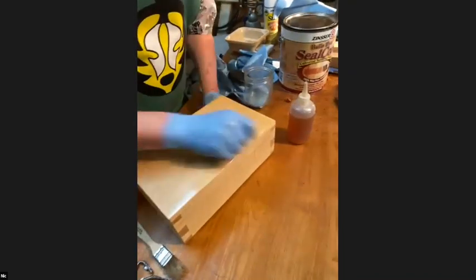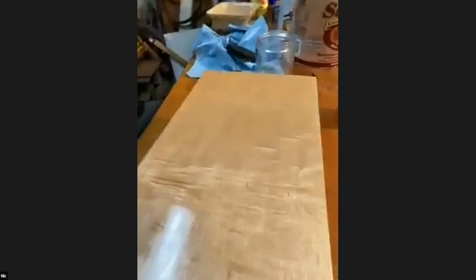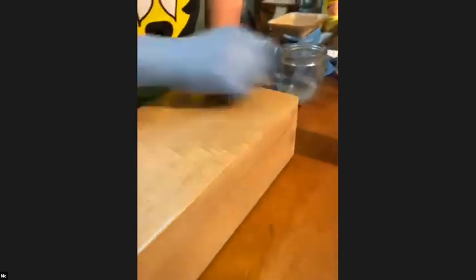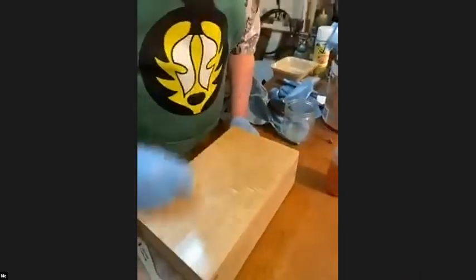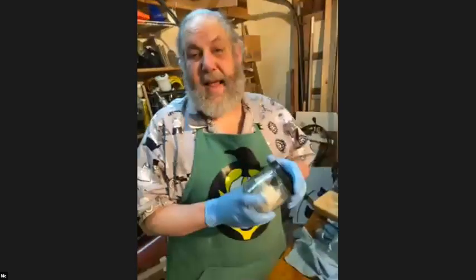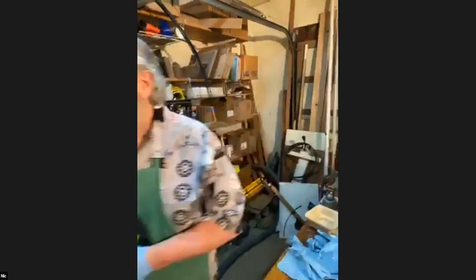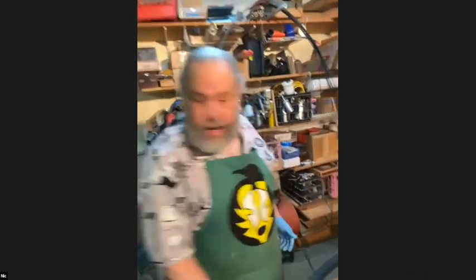You can continue by spraying, or continue by French polishing, or change your finish entirely. Shellac is a wonderful base for almost any other finish. If you want to put lacquer on, do your first base in shellac — flood it on, wipe it off — and switch to lacquer or polyurethane the same way we put it on raw wood. It's a really nice universal finish that goes well with almost anything else.